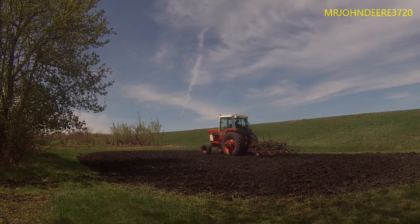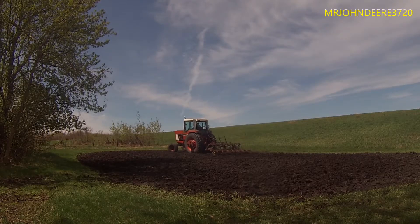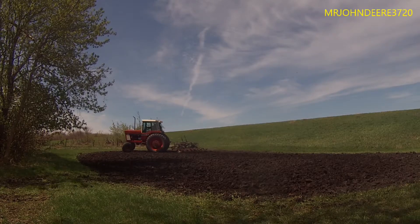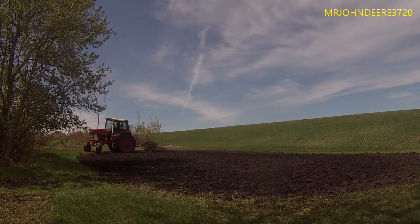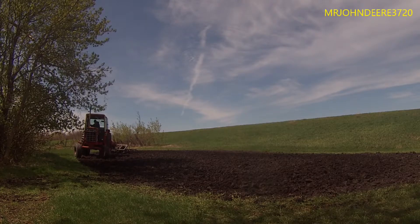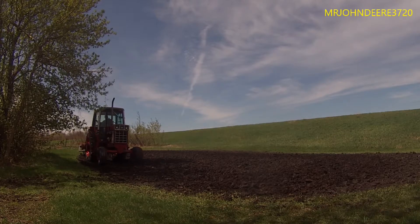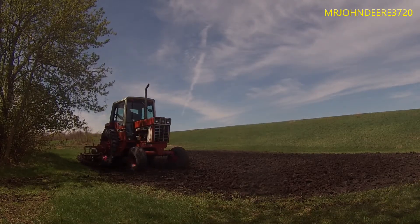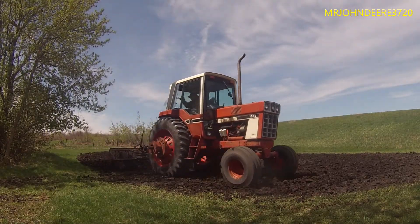Got to get rid of that trash or you're going to have a mess. I do like this cultivator. Of course, when it has its fits, it has its fits — like that time it wasn't lifting. I think that's just because the chain comes loose. There's a total of four chains, but the two drive chains come loose. The other two usually don't do anything, but the first upper two always seem to get slack after a few rounds.